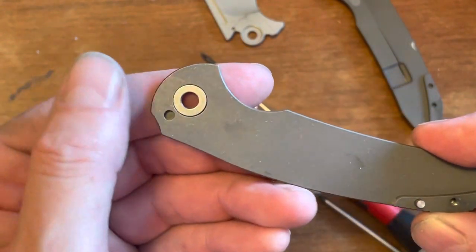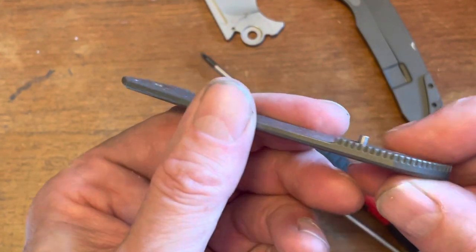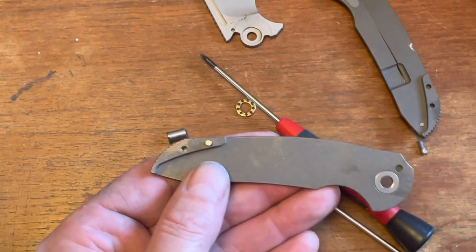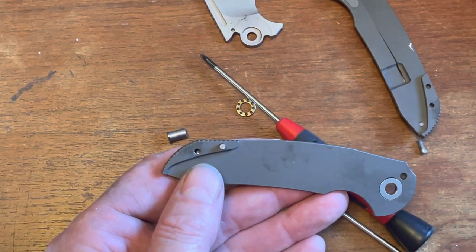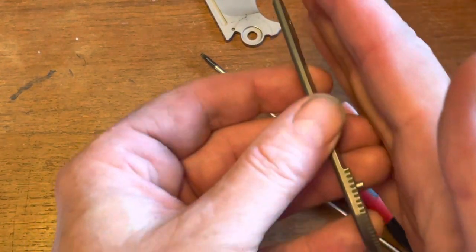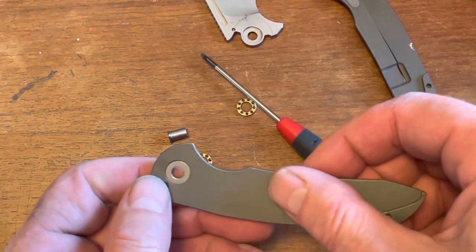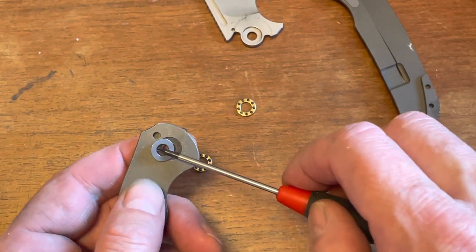You can see that this backspacer is milled out of one entire slab — it's not a separate piece. Does that make it any better? Well, instead of having two seams in the back, you only have one, which can only help a little bit. You'll have less chance of your scale slipping side to side and throwing off your centering. And it's probably going to be milled a lot more flat compared to just being cut off a sheet that's already set to thickness.